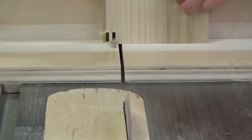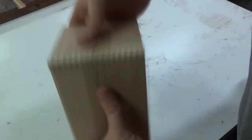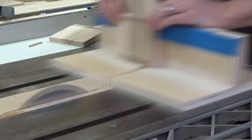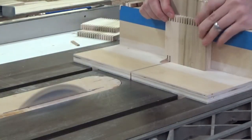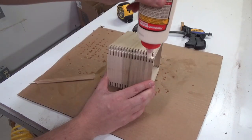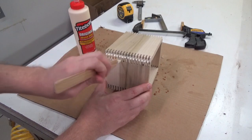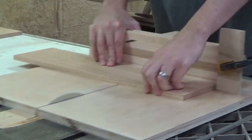So it's at the right height. Using that little key, I can offset one of the boards one eighth inch width of the kerf. Then stepping the boards over the top of that other little stationary key on the jig, you can cut a finger joint. Pretty easy — they snap right together. It's always nice when it fits perfectly. In this case it was a little tight. So once I had that concept proven, I went ahead and continued cutting all the finger joints for all the rest of the sides, the front and back and left and right side. Gluing them up can be kind of a challenge — I figured I was going to try just doing them all at once. So it is kind of important to get all that glue inside of there, but I managed to do that and get it clamped up.